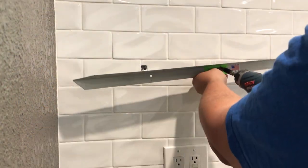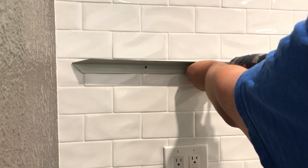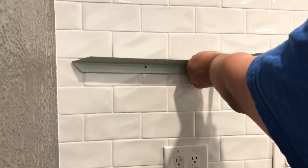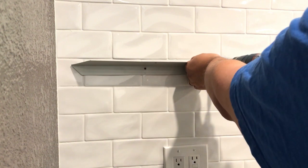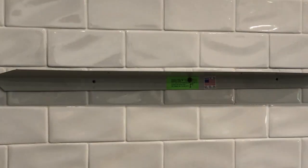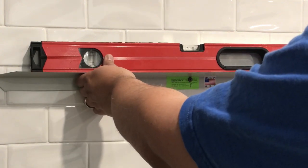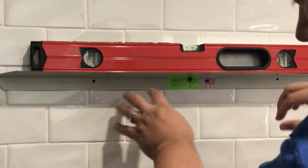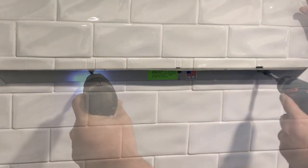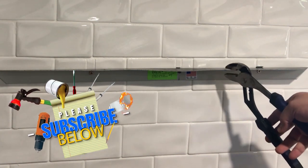My next step is to install the bracket. If this is the first time installing onto drywall, remember you want to create a pilot hole on your stud — that's the initial screw for the bracket. Once you've done that, mark up the two holes on the sides for your anchors. Make sure you have a level so your shelf is nice and straight, and once leveled off, grab a pencil and mark those two anchor points. Because we've already done this, I've already measured, leveled, and created those pilot holes and added the anchors — it's already level. But if it's your first time, please be sure you do that.